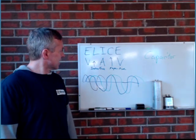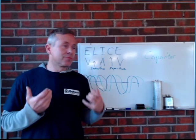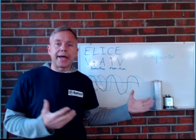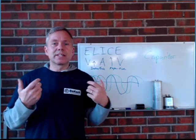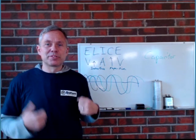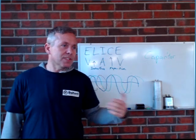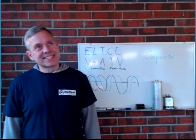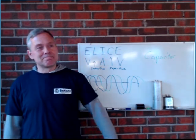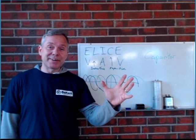So that's why you use the capacitor. I hope this made a little bit of sense — I know I flew around a little bit — but I hope it gave you an idea of what this is and how you can play with it. I myself have done it many times on older tanning beds, added banks of capacitors to the existing ones, because they still have some capacitance and still have effect to pull the inductive load back, just not as much as they used to. By adding more of them you can maintain some of the old ones, though it's a bit better to just replace them in a cleaner environment. It's a potential way of doing it. Ken from Tanning Bed Repair Guide — take care guys, bye!